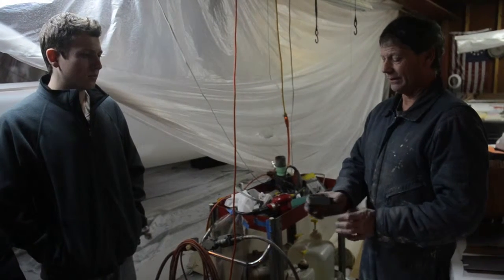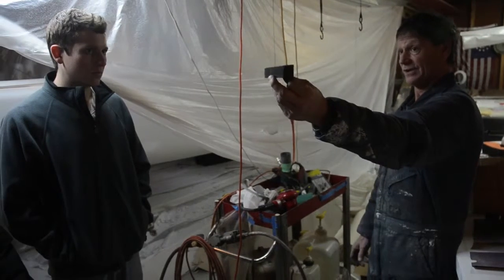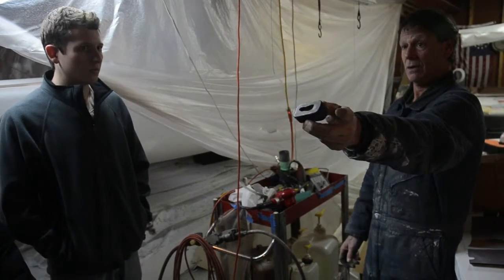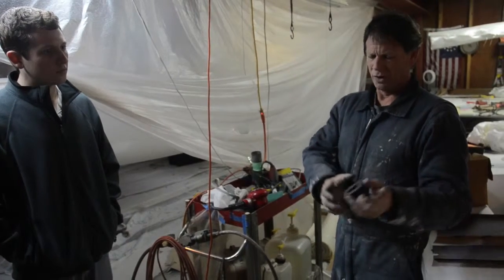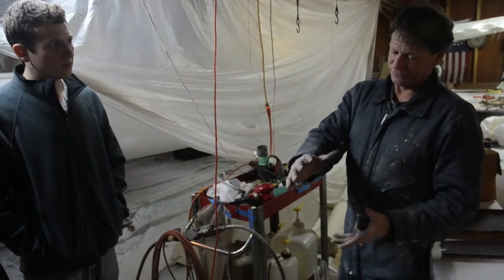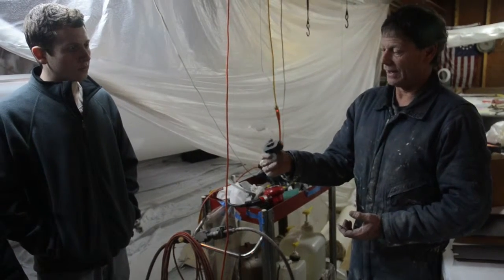So I'll get it in the correct outside diameter, thin wall, and bush these. So I'll make a tall hole. You just stack them? Well, yeah, I'll sleeve it. And wherever it has to go through the boat, I'll put this stainless bushing, and then this carbon post will run the rest of the length.